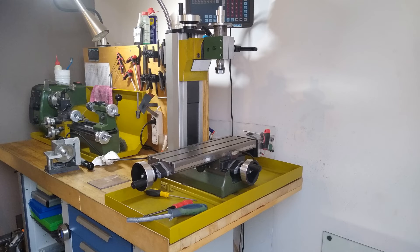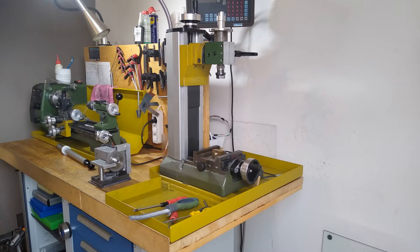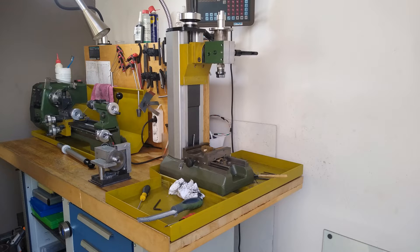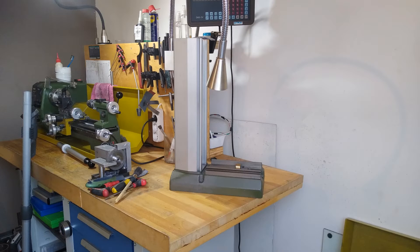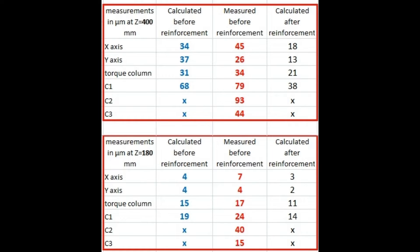Because this table shows that practice and theory do not completely disagree with each other, I have a starting point to see whether strengthening the column makes sense. An obvious choice for this is epoxy concrete, a mixture of stone and cast resin. If I fill the column with this, the resistance to bending and torsion should increase. In addition, the mass of the filling will also counteract resonances, because with the current thin walls the column may have similarities with a Tibetan singing bowl. I assumed a shear modulus for epoxy concrete estimated quite modestly at 2 gigapascals, and calculated what the resistance to bending and torsion would be if the column were completely filled. The results suggest a roughly halving of the deflections, which seems very worthwhile. So I decided to strengthen the column.